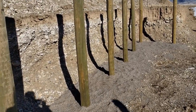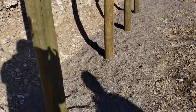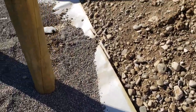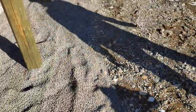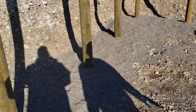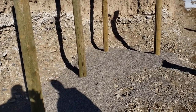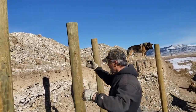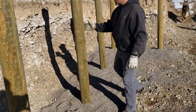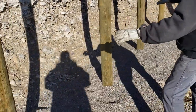We're looking at the north wall of the wallapini right now. When the cages are set over the top of these posts, the height will be about 5 feet, which is what we wanted on the back wall — it is not a bearing wall. Before we put the cages down, as we showed in a prior video, we put the hardware cloth on top, then the canvas filter cloth and then the pea gravel. Before you place your cages, you want to make sure you've graded this so that it is level and that you tamp this area down very firmly, because you want those cages on a very stable base. We'll set that 20-foot section over the top of these posts, the pea gravel will be to grade, and then we'll staple that cage to the backside of these posts for support before we start filling it with rock.